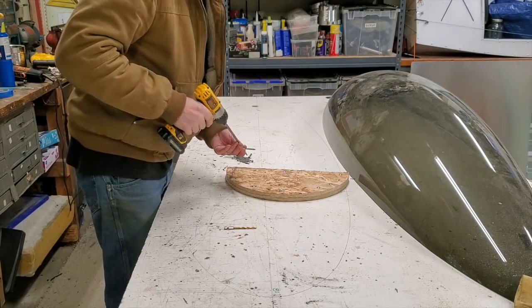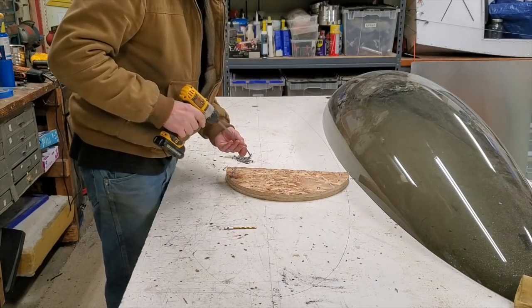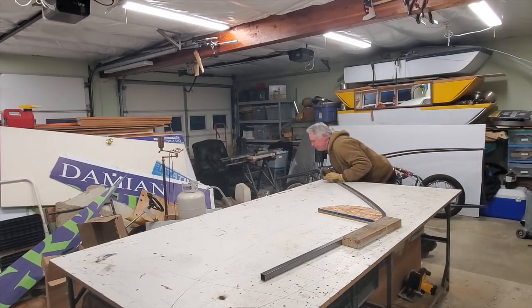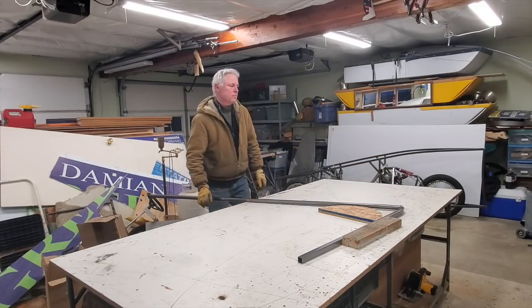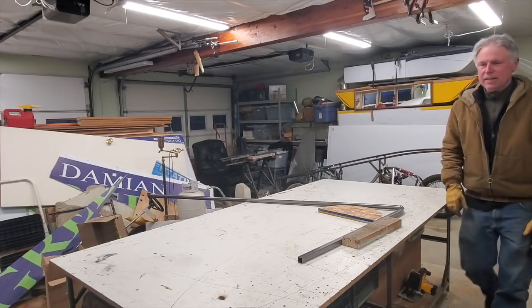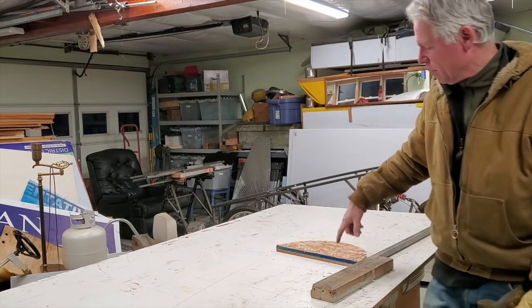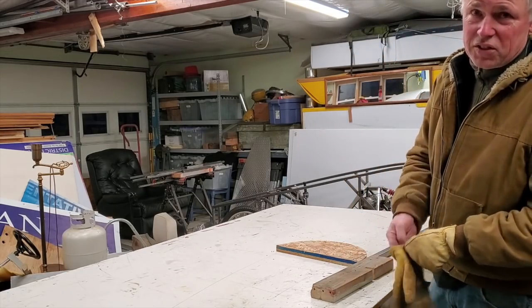This is my bending brake for my roll bar. I know what I forgot to do. Well, I won't do that again. Forgot to secure the end of the tube. Drilled a hole and put a big screw in there so it shouldn't do what it just did.